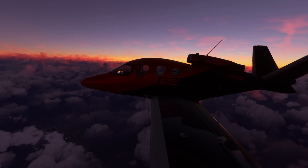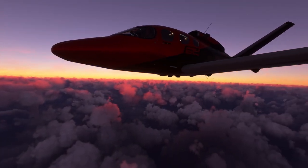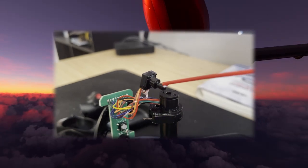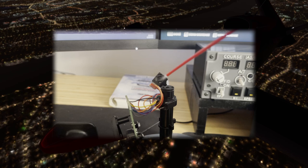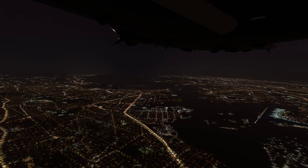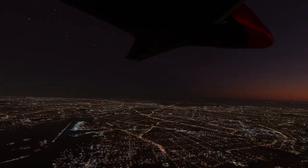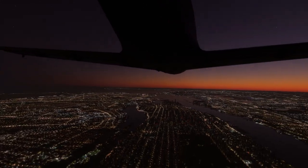Go ahead and remove the rest of the plastic. First, pull the potentiometer out of its housing and, using either the electronic spray or a cotton swab with alcohol, clean it off. While this step probably isn't strictly necessary, it could help, and it's better to do it now than wait until you have to rip it all apart again like a piece of IKEA furniture you put together backwards. After all the parts have dried, which should only take a few seconds, you can start reassembling everything.